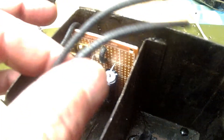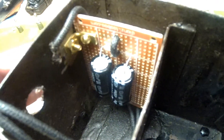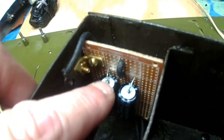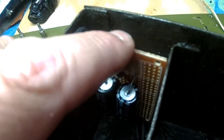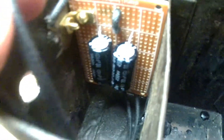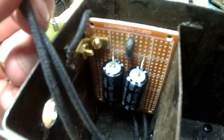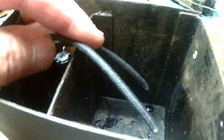Here's the capacitor board mounted inside the can with the homemade bracket. This is the negative sides of the capacitors, hardwired to chassis ground. I soldered it to the chassis to make sure I got a good ground. The other two leads go to the capacitors — it really doesn't matter which because they're both 10 microfarads and they go to ground. This will go to various parts of the choke.